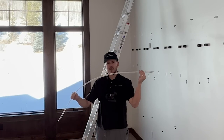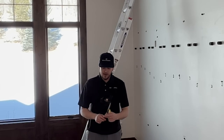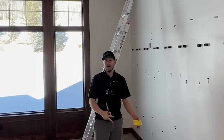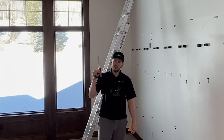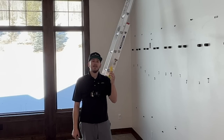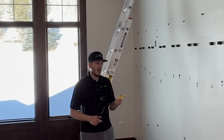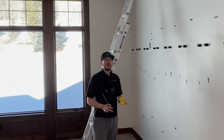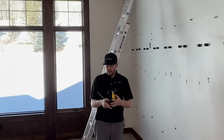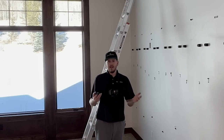You can pick fish rods up at Home Depot or Lowe's. They're great — you can attach as many as you need together; they're flexible yet rigid, which is the perfect combination for running wires. You'll also need a hole saw — you can use a manual version or a battery-powered option. I always use the manual hardwired option because these are super cheap and everyone has access to them. This is a single gang template, which you may want to pick up for a retro install to use as a pass-through plate. You'll also want some electrical tape for attaching wires.